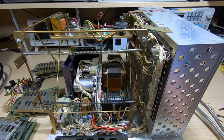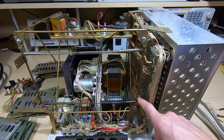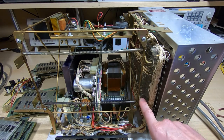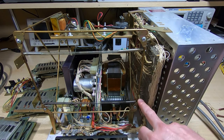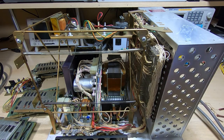I don't have the CRT out of this unit, so I'm going to swap the CRT from the first unit. I could in theory swap the entire CRT chassis, but because I want to test the driver board I might as well swap just the CRT. The next thing I'm going to do is plug all the cards in.